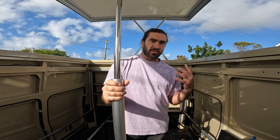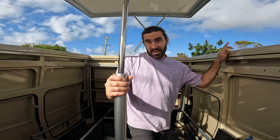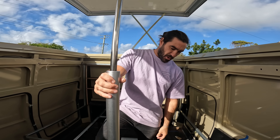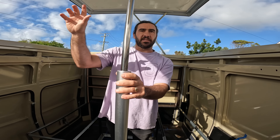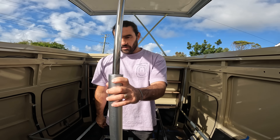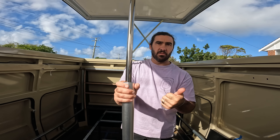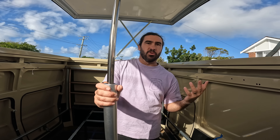It's quite difficult at the moment to lift and lower, so these will do all the work. The idea was to mount these on the outside of the truck if they were a certain length. Silly me didn't measure the overall length — I didn't take into account the motor that's built into this bullet-style actuator. I thought 900mm, perfect, that's all going to work. But it's not 900 — it's like 1,400. So it's not going to work on the outside. And what I'm worried about is if actuators are on the outside, they get rain, dust, branches — if one gets knocked, that screws everything.